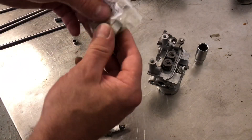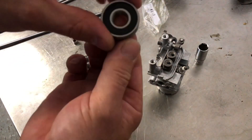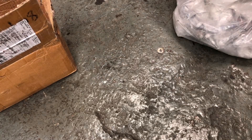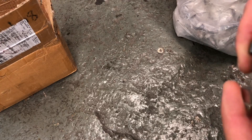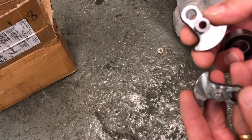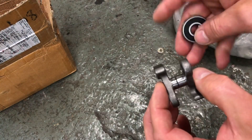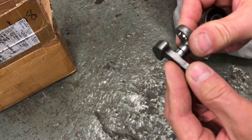I've got some crank bearings and I've got some cranks. Here we have some cranks — I need to machine them down. That's the 12mm bearing. I'll bore out the crank so that it fits together, and then the bearing goes over the top of the joint. It needs to be a press fit.